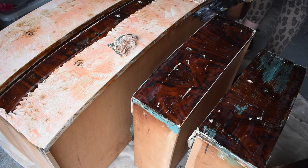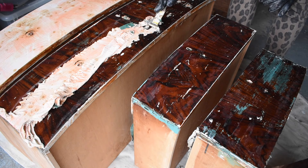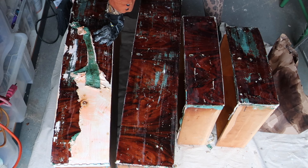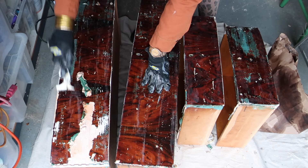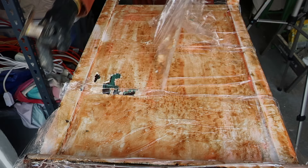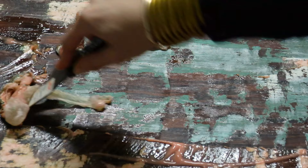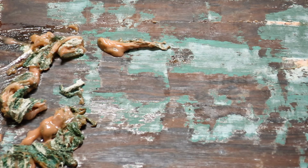I used a five-in-one painter's tool to scrape the paint off the surface. Be careful with a metal scraper not to scratch the wood — with delicate wood a plastic scraper might be safer. I dumped the scraped paint into a paper bag, and you'll want old rags and paper towels handy because this is the messy part. Placing plastic wrap over the stripper after applying it prevents evaporation and can give better results. My dresser had two coats of paint, and in some places the bottom green layer didn't come off right away, so I had to apply a second coat of stripper and repeat the process.